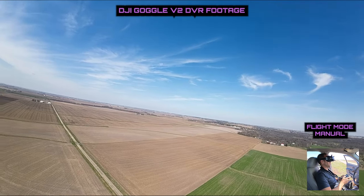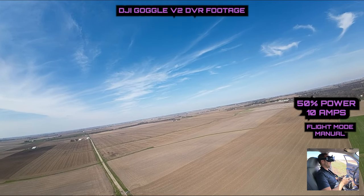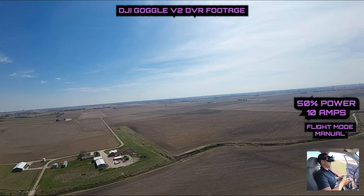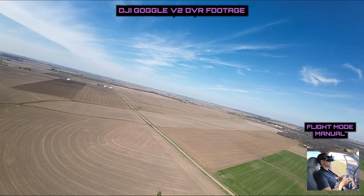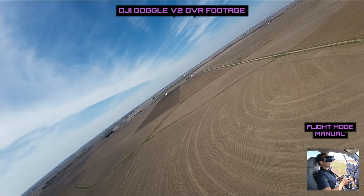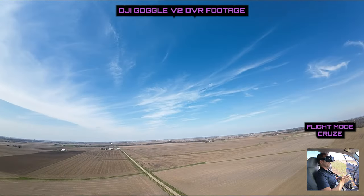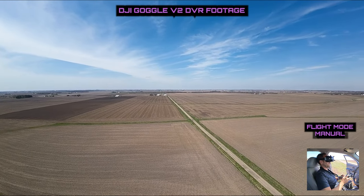Efficiency-wise it's a hard one to test. At 50% throttle I'm pulling right at 9 to 10 amps going into the wind. Going with the wind it's still about 10 amps — no big deal. That thrust angle modification made a huge difference. Center of gravity feels good, she turns decent, doesn't feel too heavy at all. Let's go to cruise mode — I'm not liking that. I think we need to do an auto-tune to get those PIDs adjusted, especially since the flight controller has moved.